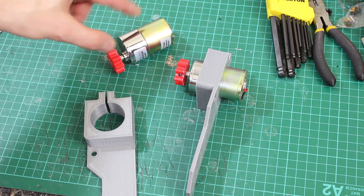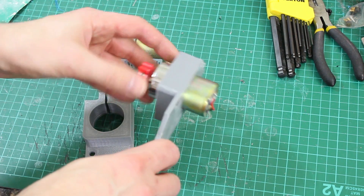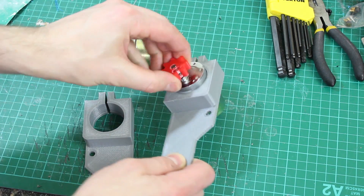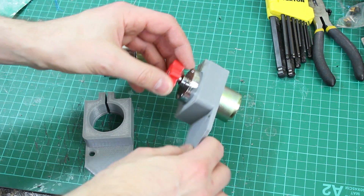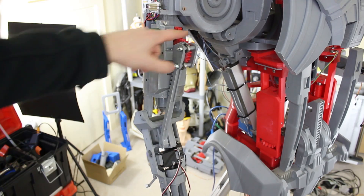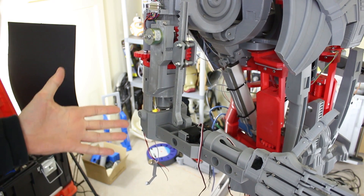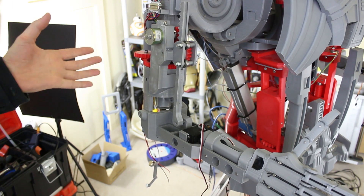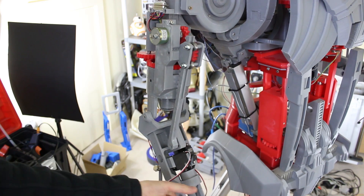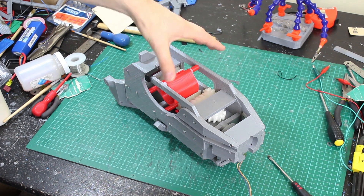The motor has an offset shaft so we can rotate it around to get the gear spacing exactly correct. I made a modification before printing: a slightly fatter section at the bottom so there's a step, because the motor has a gearbox which is wider — it grips both at the back and front but still allows forward/backward alignment. Here are the printed parts and motors; having that step means this can still be adjusted. The piece can be moved all the way around to bring the gears closer or further apart, and clamped with a bolt and nut.